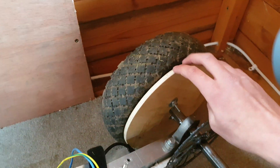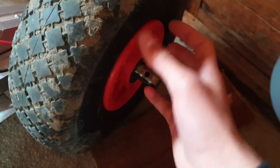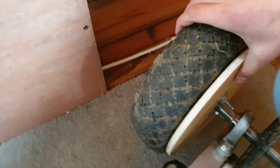So that actually works. I've also put this piece of plywood on there, because the wheel isn't actually secured to the tyre — the wheel slips independently of the tyre. That meant it was rubbish with this more powerful motor. So I've put that on there really tight so it just friction-holds it in securely. It works quite well actually — it doesn't slip anymore, so we've got plenty of traction.